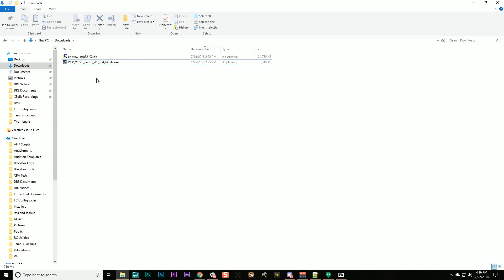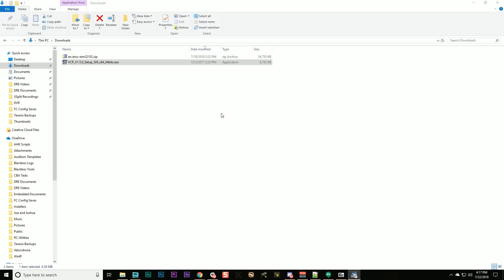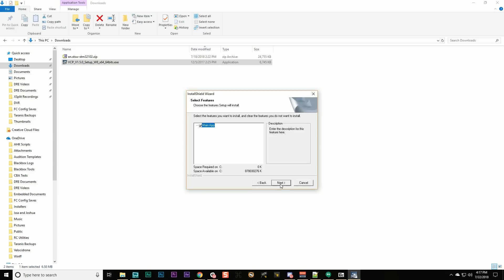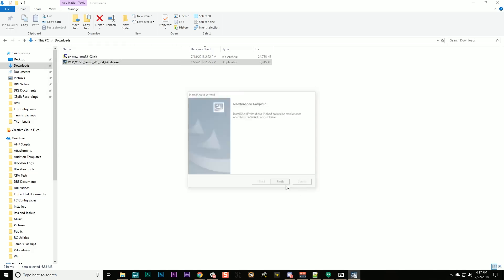For those of you on macOS or Linux, your operating system comes with these drivers pre-installed and you don't have to do any of this — feel free to skip ahead to the next section. Windows users, continue. I'm going to drag this file out of the zip and double-click to run the executable to install the drivers. I already have these installed so mine will go quickly. You should see: STMicroelectronics USB ready to use. Your drivers are now installed and you can continue.